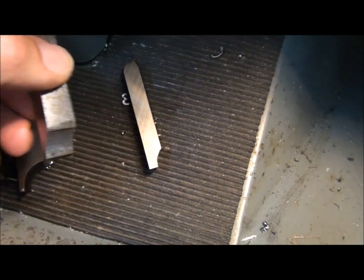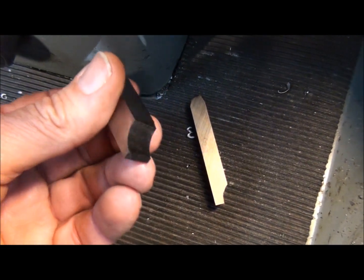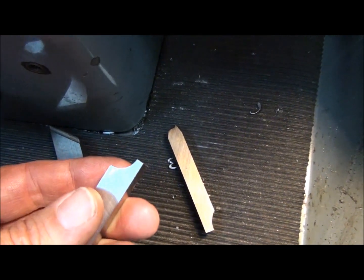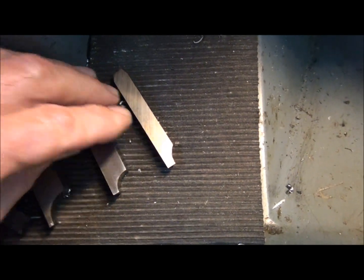There's a lot of work that goes into making a tool like this. This one I kind of cheated — I used a surface grinder on it, but you can make them by hand. Just get your radius gauges and go to work on them with a pedestal grinder, and with a little care you can end up with a pretty nice looking form tool. But it's a lot of work.